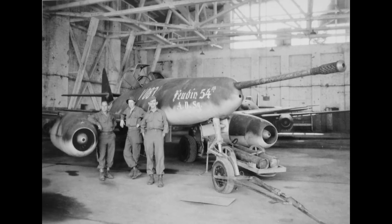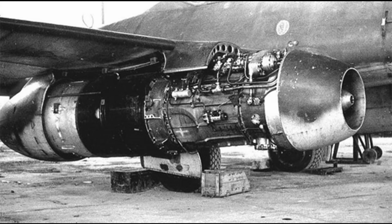The flip side of this, though, is that a propeller airplane with some fixed amount of horsepower, let's say it's 2,000 horsepower, will lose thrust as speed increases. And drag will be going up as speed increases. So this acts as a double whammy to limit the top speed of propeller airplanes.